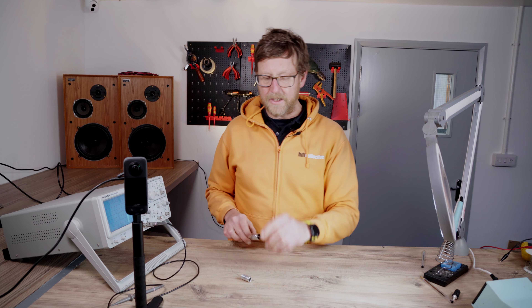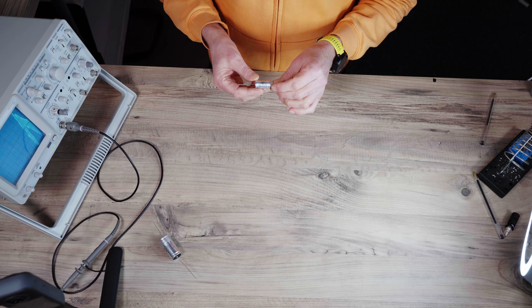Generally that is the output. So imagine you've got the anode — the anode lead connects to the inner foil, but the outer foil is the output end. I know it's a bit confusing, but let me illustrate with this cap.